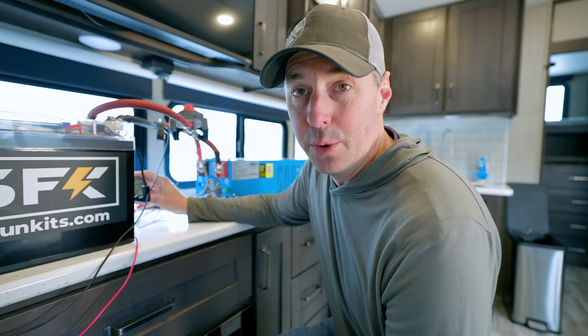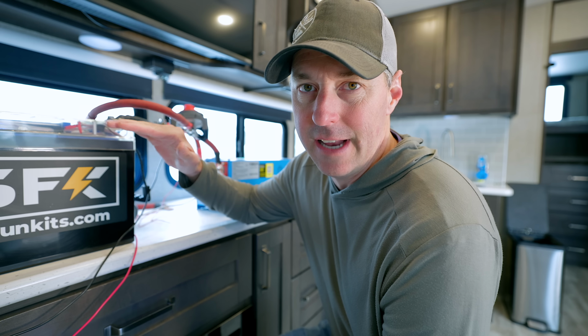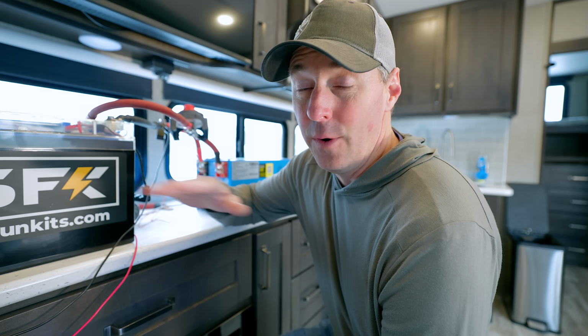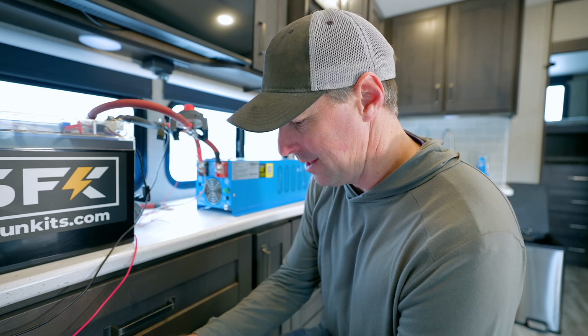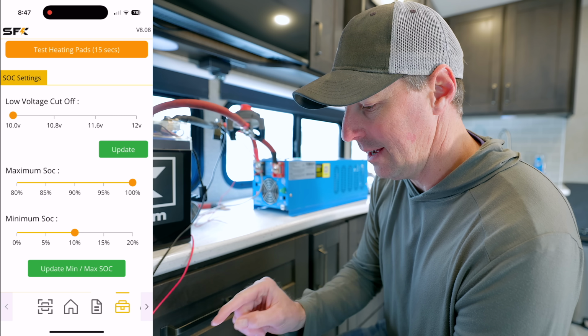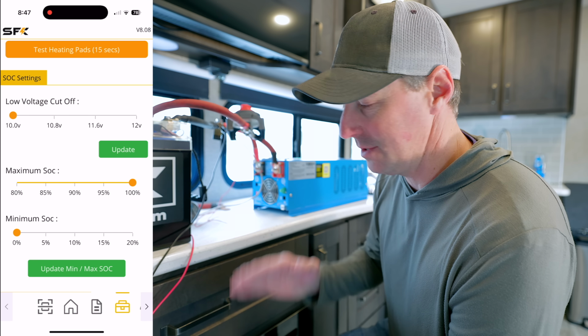We're at just over 250 amp hours drawn for the capacity test, and the BMS shut it down, which is surprising because the voltage wasn't even getting close to dropping. So there must be another setting in here. Okay, the state of charge, I had that set not to 0. So that was shutting it off.